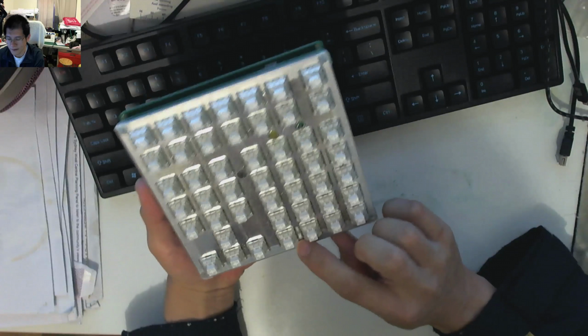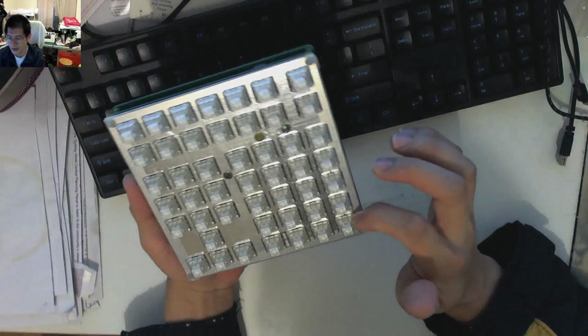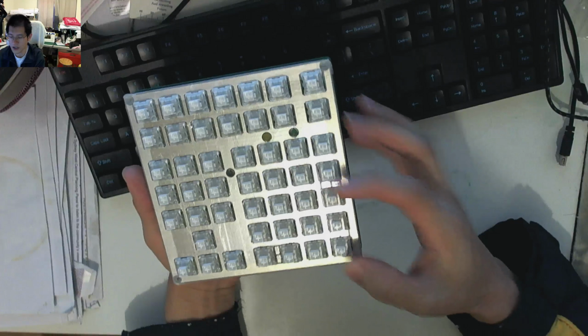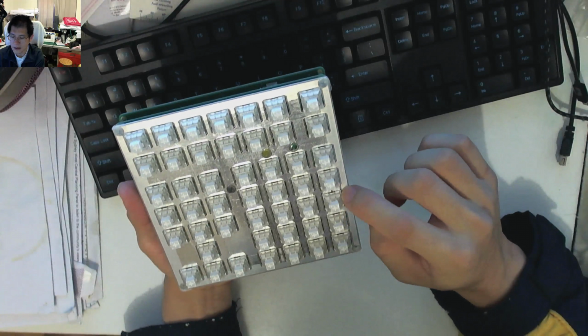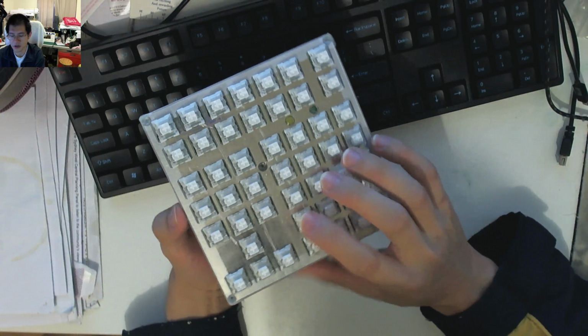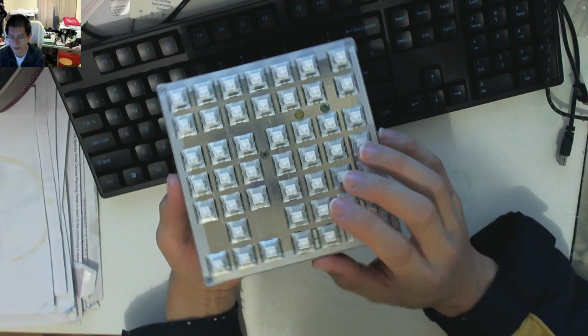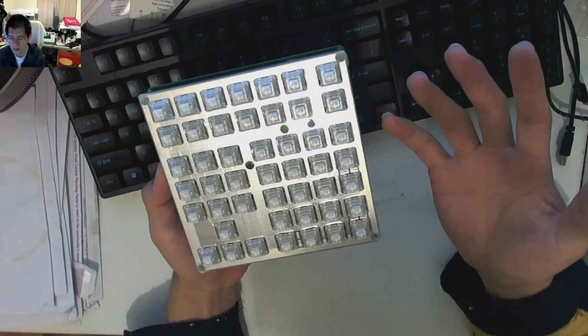My failures in regards to the plates being snap offable, score and snap, is just something that I've kind of left at the moment. And of course this particular layout is for the grid formation, but the PCB of course is set up so it does have 2U compatibility. You can build this without the plate, but because I'm using Box White switches, I need the plate to keep them nice and aligned, because the Kailh Box switches don't have 5 pins, they've only got 3 pins.